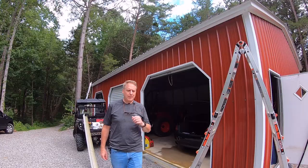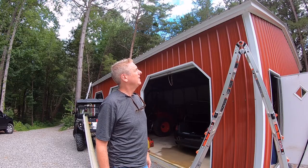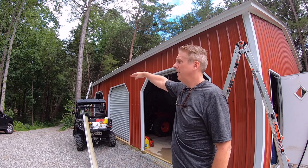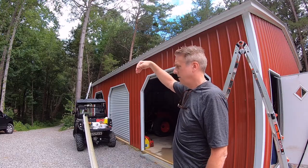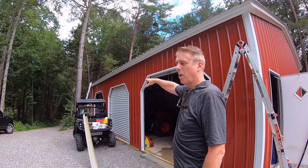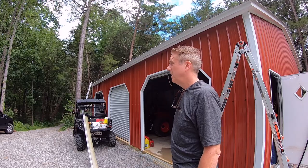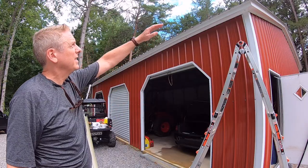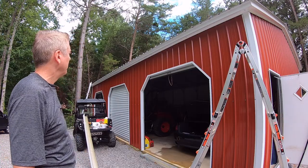All right, let's get going. So I guess the thing I should say before I begin, which maybe is obvious, but for people maybe it's not obvious, right? Because I want all the water to go off and out that way to the end, eventually I'm going to put a big collector tank around on the back side and have my gutters flow out to that, so I can have a water reserve over there mainly used for washing cars, watering plants, things that I don't have to necessarily run my well to do to get the water. So I just wanted to share that, the fact that this end needs to be at the very highest, and it needs to slope a little bit, so it might look a little crooked when I'm done if you step way back, but that's intentional,